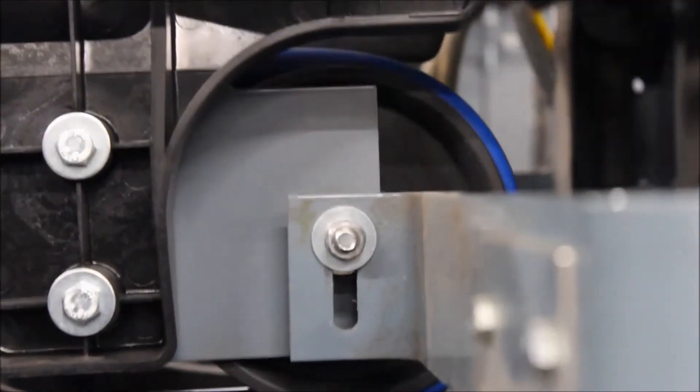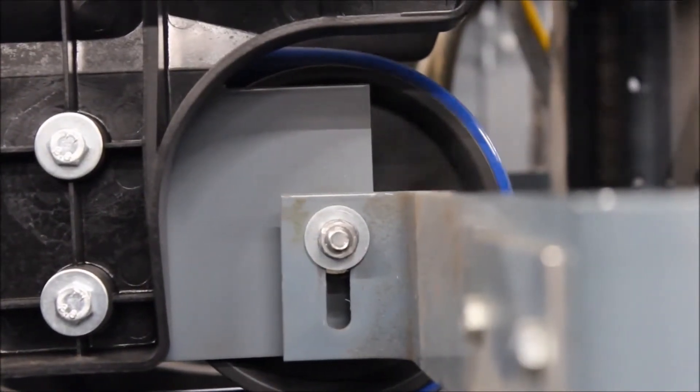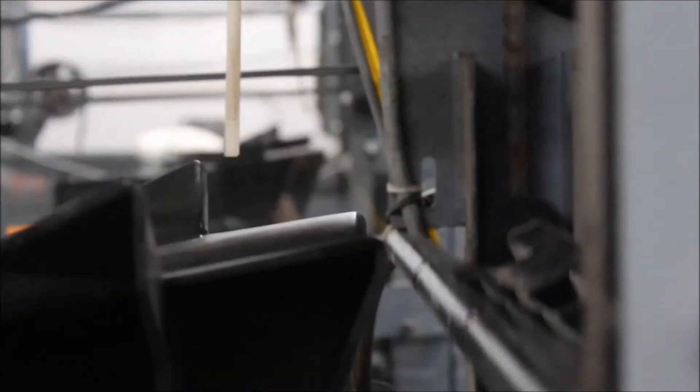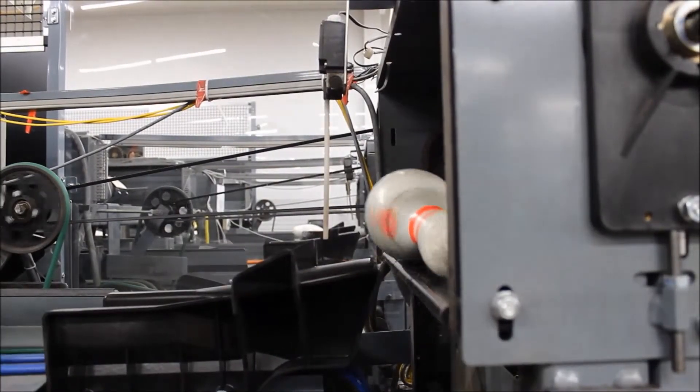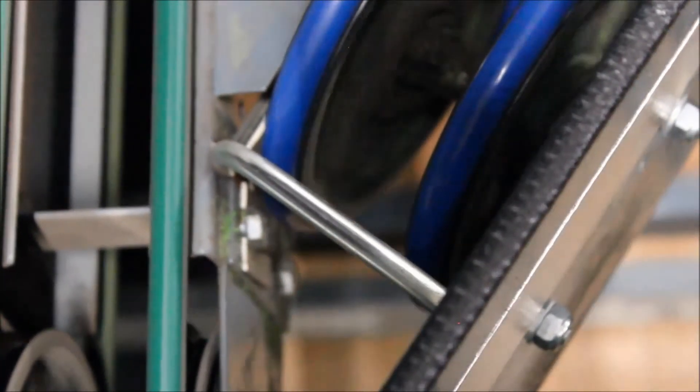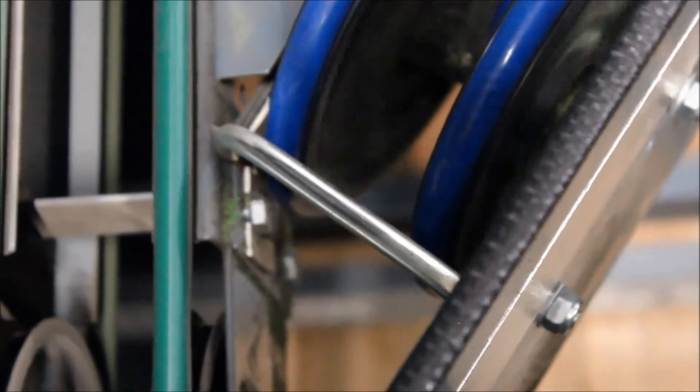The next thing we want to do is look at our adjustments to make sure that everything is adjusted properly before we start making any other changes to the machine. We want to look at the adjustment for our shark and also the adjustment for our corner belts. For the shark, you want to make sure that you're adjusting it to the top of the adjustment slot, and then adjust your shovel cam so that you achieve at least a 2 millimeter gap as the pin is transitioning onto the shark from the shovels. On the corner belts, you want to make sure that you have your guide bracket or guide wire adjusted as high as possible.